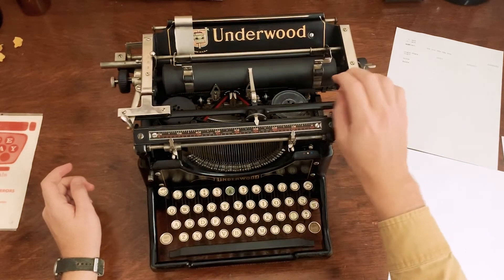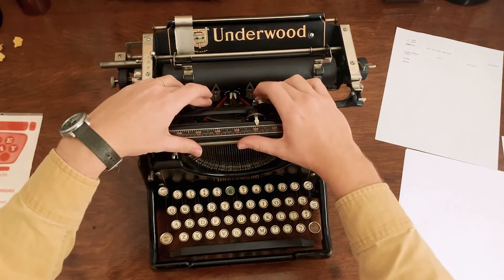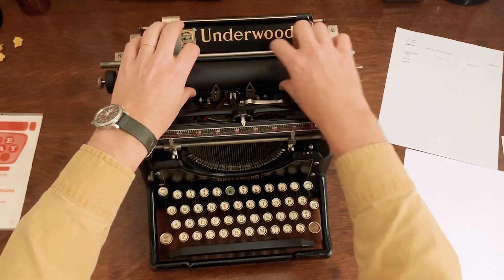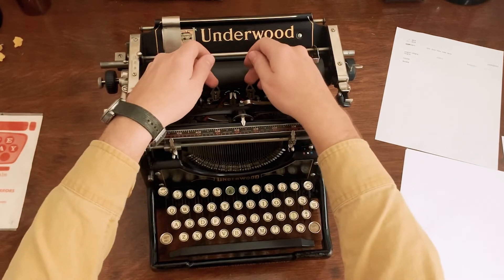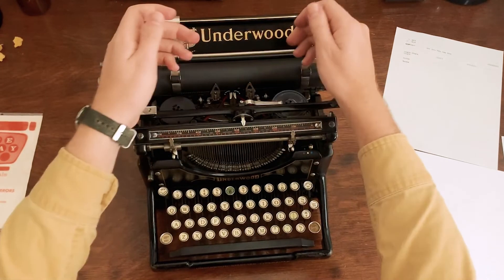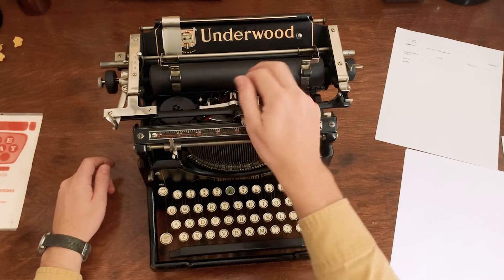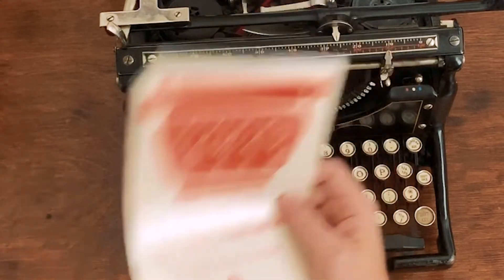This little piece I think is just for holding cards down if you're typing on cards — same with those two triangular pointer-looking pieces. Those are also card holders for any paper that isn't big enough to reach the rollers on the sides. Fortunately on this typewriter the platen — the roller — is in really good shape for the age. It still has some rubbery sheen to it; it is pretty hard but it does grip the paper. On a lot of typewriters this old the platen has completely cracked and fallen apart.